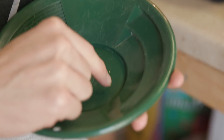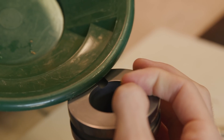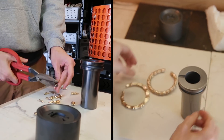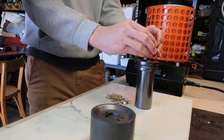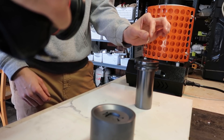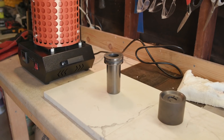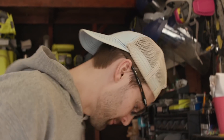Safety is the number one priority. We've already tempered our graphite crucible — we brought it up to 300 degrees Celsius and then let it air cool. That's because you don't want it to shock the first time you ever use it and then crack. This is a way of extending the life of the crucible itself. We've already done that once, so it is time to melt this bad boy down.